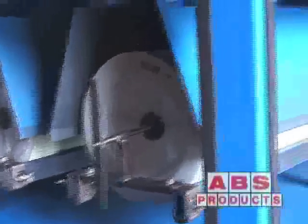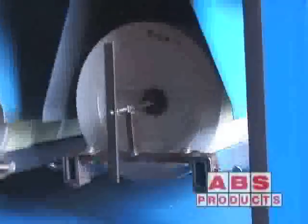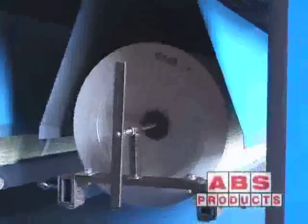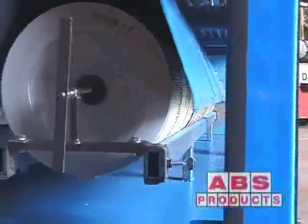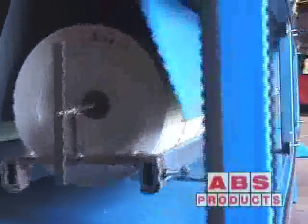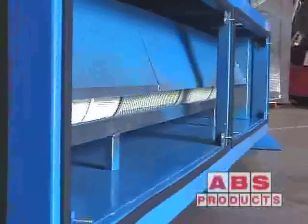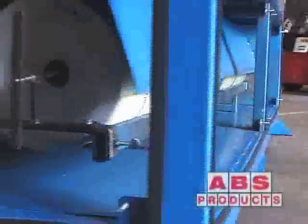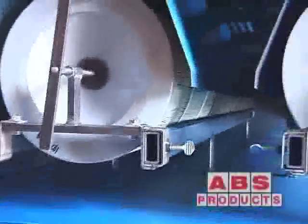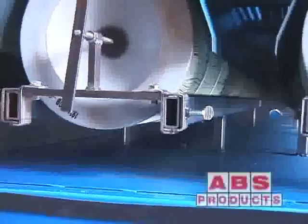As you can see, the end filters have got a cap on them and the bars tighten up to seal them off. To change the filters, the whole end slides off and all the filters slide out — just put in new ones. A lot of people will run it three months and just rotate the filters 180 degrees. It's shielded so debris doesn't go directly to the filter, and these are all fire repellent filters.